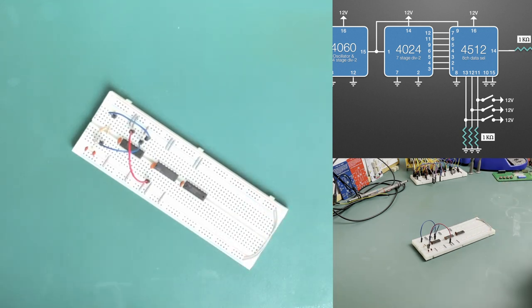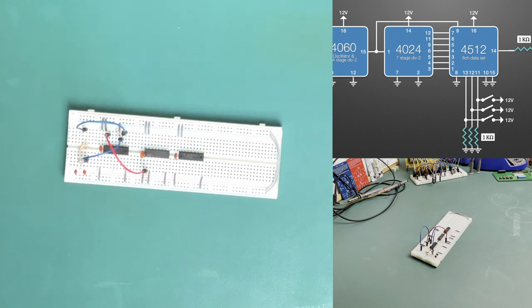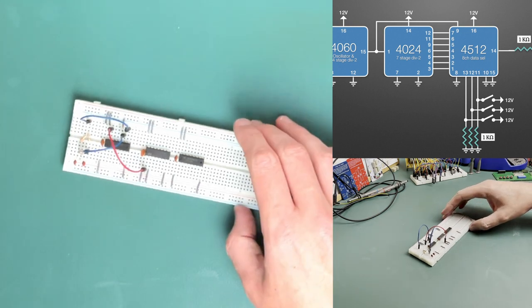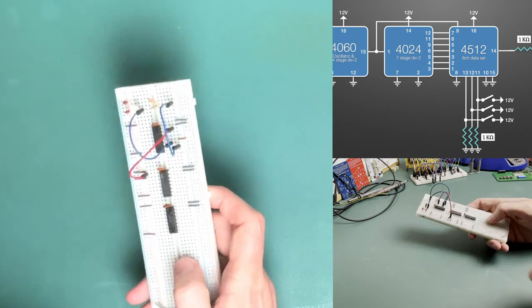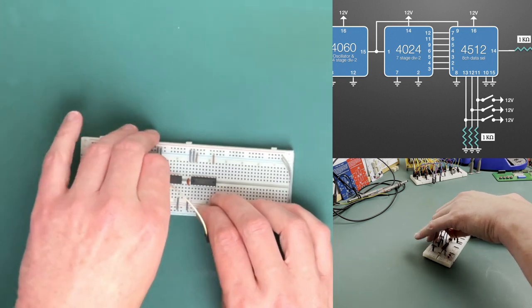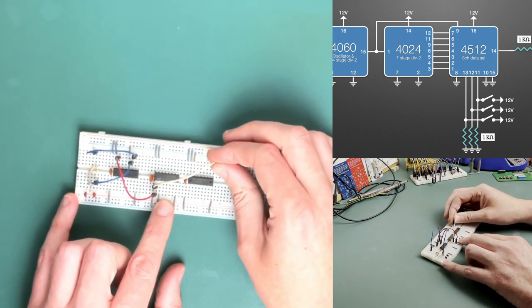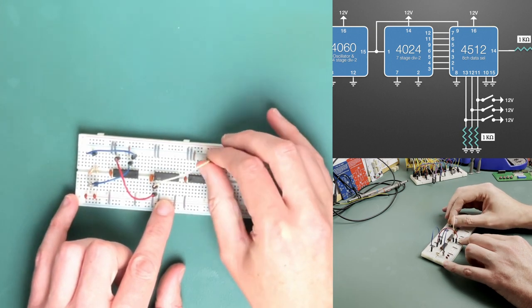We need the ground line for the chip and the ground line for the capacitor. There are a couple of lines we need to ground off, mainly about enabling the output. There's also a tri-state function where it can make the output go high resistance - almost like they come off the circuit. Both of these we want turned off, so we just need to pull them down to ground. Now we need to start giving it some inputs. The first one I'll transfer over is the 32 Hz, coming off the input pin and passing it directly over to the pin at the top right.